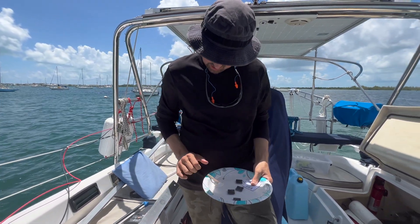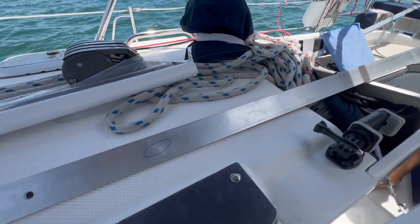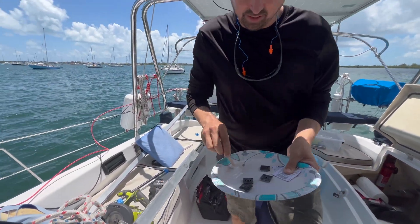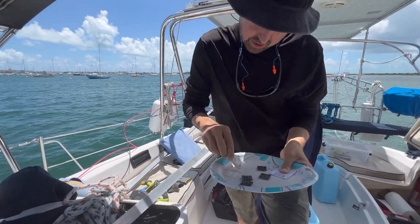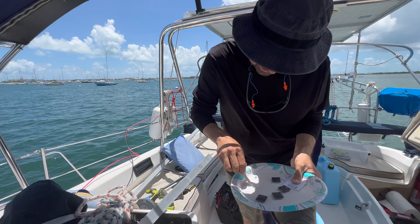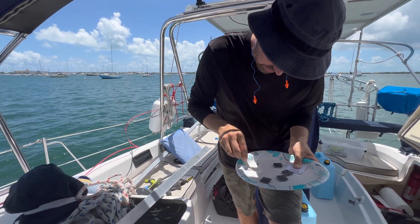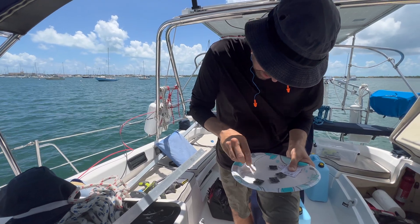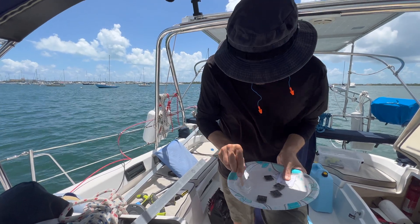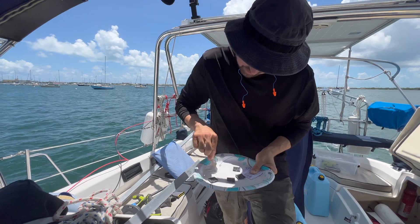You can see I drew some circles and scuffed up the aluminum. I've used this epoxy a few times — it's very good. But when you're using anything that makes adhesion, the adhesion is only as good as the contact with the surface. If it's a really smooth surface you have to scuff it up a little bit so it can get into the pores. I don't think we'll ever have to address this again, but we'll see.